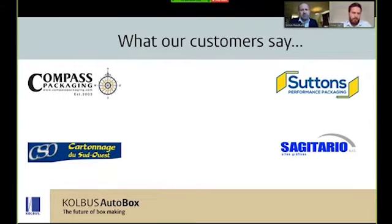And over to France now. They bought the machine for a particular style of box, an 0713 crash lock design in B flute. It had a very unusual height of 1,100 millimetres, which was previously closed using a hot melt adhesive. The MultiNova automated this process and enabled them to apply PVA, which again enabled them to be more effective and consistent in their closing methods of this challenging box style.